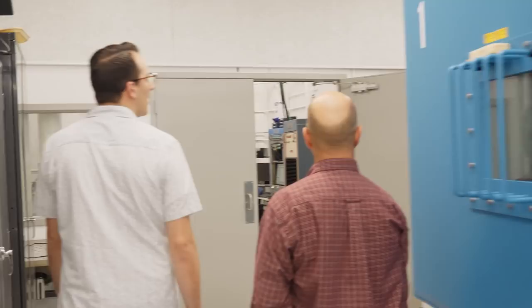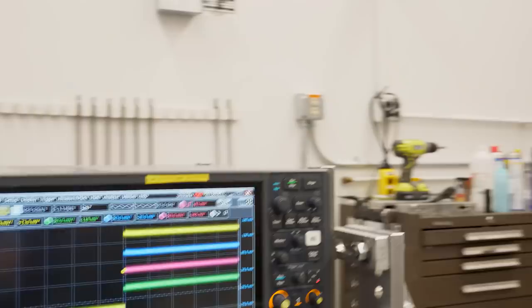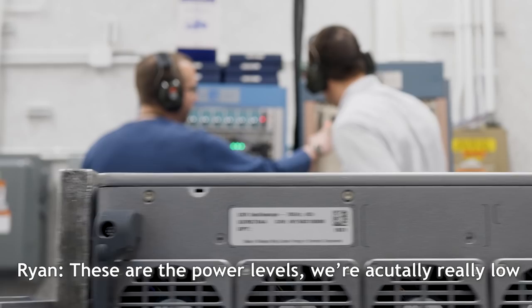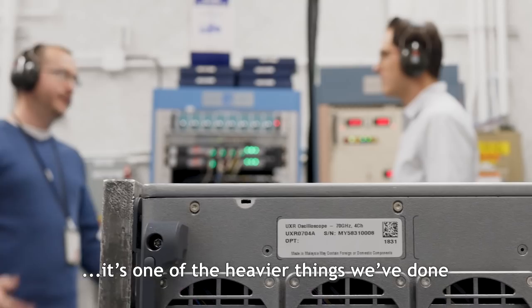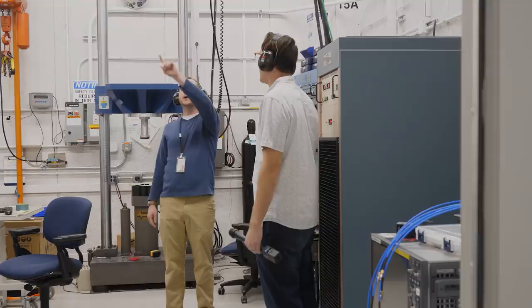In here is probably the equipment abuse room — we call it the mechanical room. We have a shake table hooked up to a UXR, and this is Ryan. We have it set up in the side-to-side orientation and we'll do a few tests: some with it running and some with it not running, which is a little bit more aggressive. You test it while it's running to figure out how much stress the device can take and still do its job, then you turn it off, shake it harder, and see how much it can take before it breaks. This helps you decide how to spec your device. They've also glued on some accelerometers to measure the g-forces in different axes.